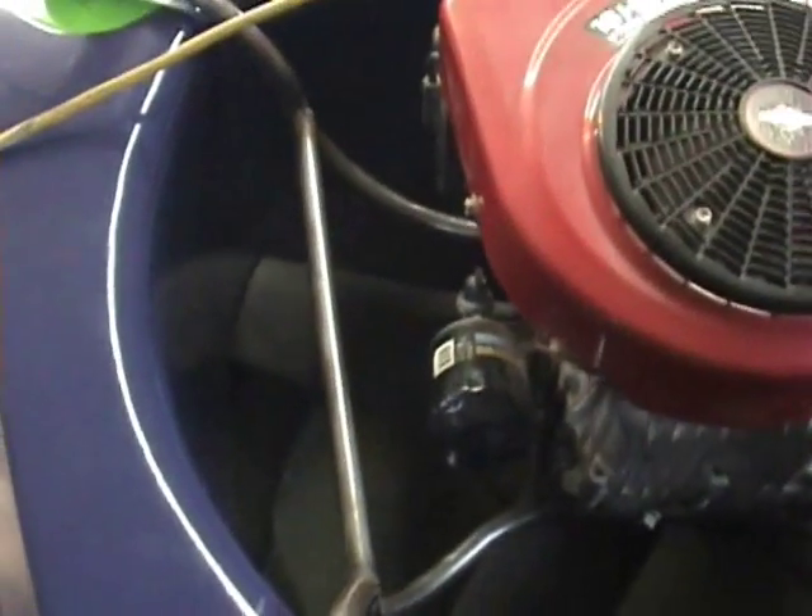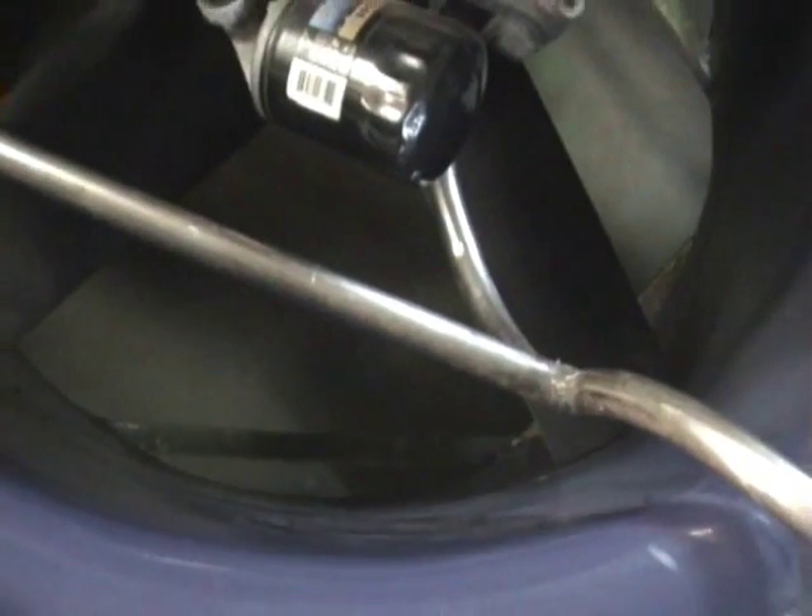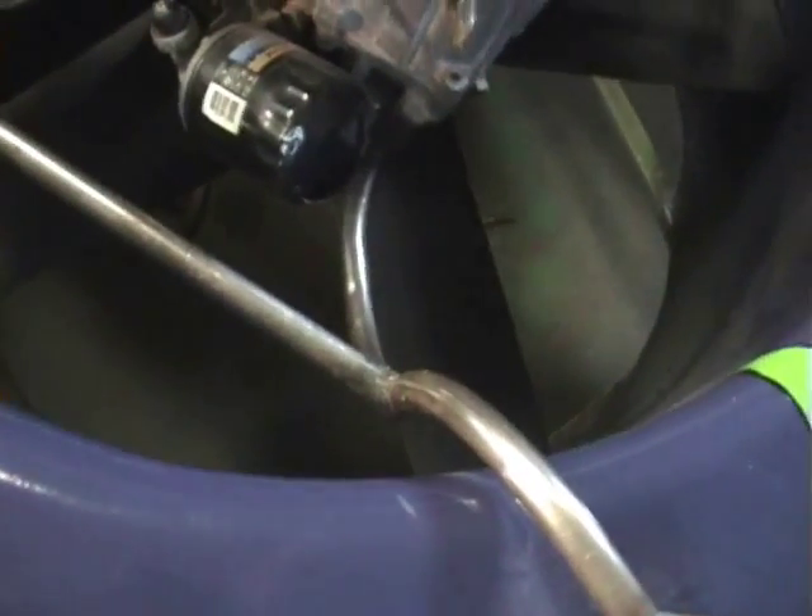It's kind of hard to see, but there's about a quarter inch clearance at that very back point — that's the worst spot. I can live with that; it's not going to be a big deal. My next project is the splitters for my inside tack strip — I actually have to build those yet. But now that I've got the engine mounted and everything's in place, I'm going to bend those out of some aluminum, which I've used pretty much throughout this whole build — to line the duct wall here and also to line my prop thrust duct in the back.